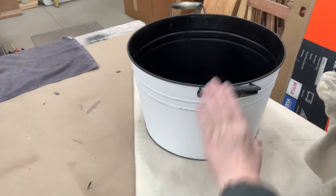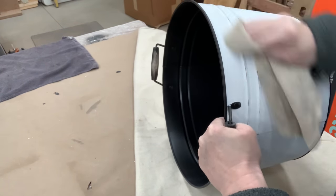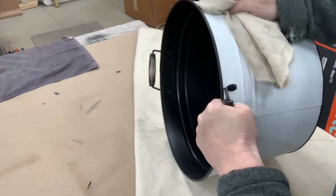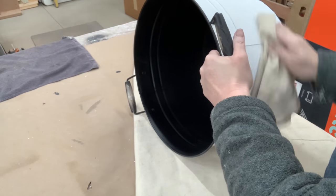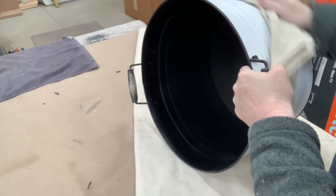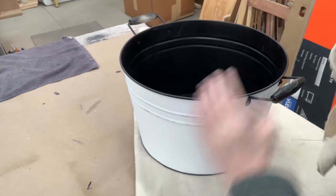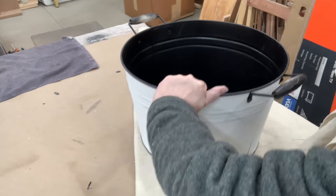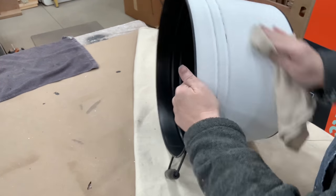And now that I have everything just water distressed or a little bit of sandpaper distressed, I'm going in and sealing this chalk paint in using some of this Varathane finishing wax. This is just our go-to wax. I found when I used the Waverly wax that it started distressing the piece a little bit more. I already chose where I wanted it to be distressed, that perfectionist in me, and I didn't want it to be distressed anymore. So we love this Varathane wax.